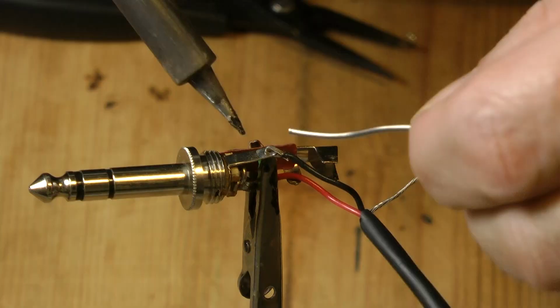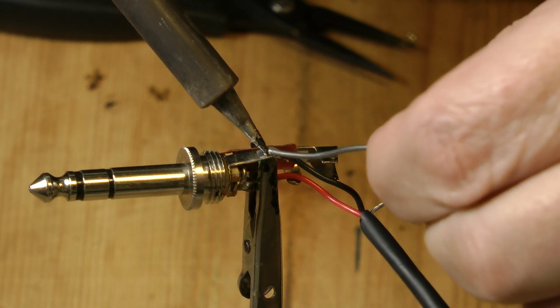So he said to me, "I've used a process called sound on sound." Now the tape recorder he had did not have sound on sound facilities. So what he was doing was desoldering the erase and record heads from one channel, recording his guitar on the other. So for example, he would record on the left-hand channel. Then he would unsolder those tape heads, the record and erase heads, play it back whilst recording with another instrument, live, onto the right-hand channel.